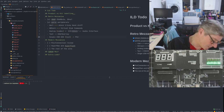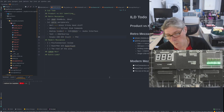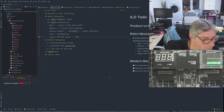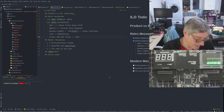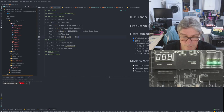So 320x240 is 76k bytes if it was 8-bit per pixel, but you might want more than 8-bit. Depends which colour space you've got it in as well. YUV 8-bit might be fine, but if it's RGB, you're going to need 16-bit probably. So that would be 76 times 2, so you're talking about 150k capture on a frame.